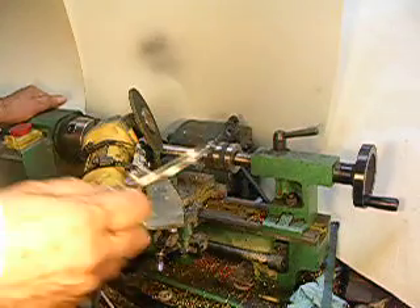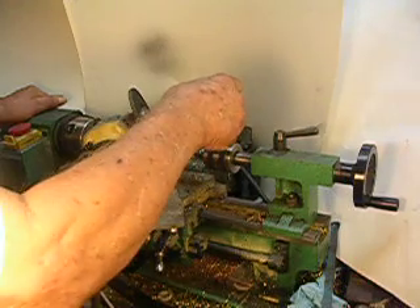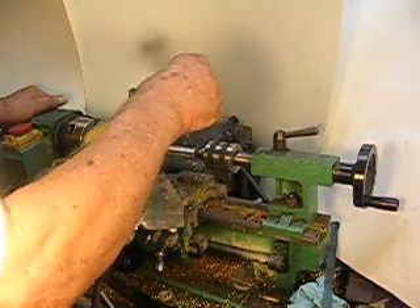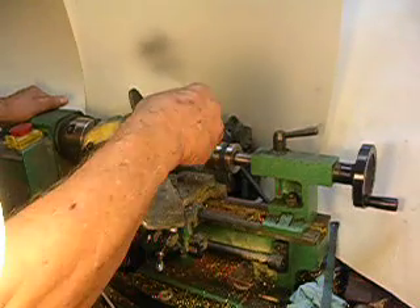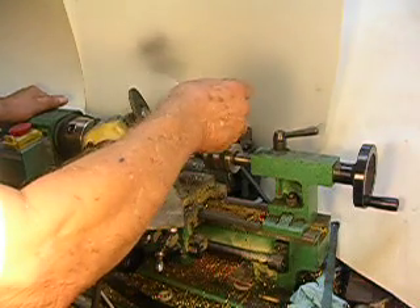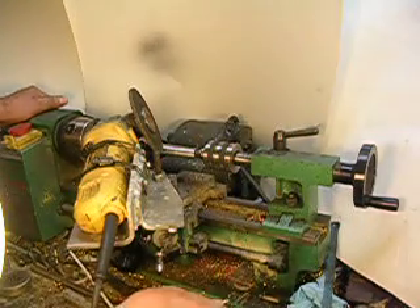By the way, I used this little divider to measure with. I don't have to keep wondering whether I've turned it down enough — I've got it set on a half inch, and that's what I want my drill shank to be. So all I have to do is place it up there and see. Well, it's not yet — I still need some more grinding.